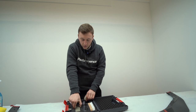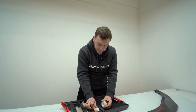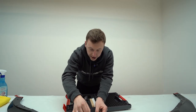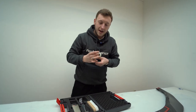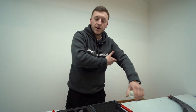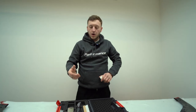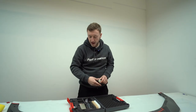You then would brush off the dirt, and use this special tape that is for this tool. You stick it on, it's really, really sticky. You pull it off, and then in the grid, it'll be literally a very small grid. Any lacquer that comes off means it's failed. The product hasn't been prepped correctly, and that will cause flaking. So if you've got stone chip, it would start flaking off if that's shown.